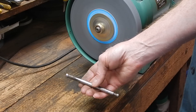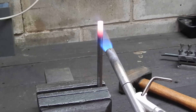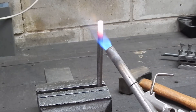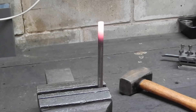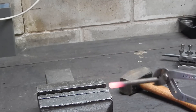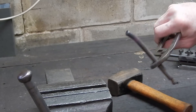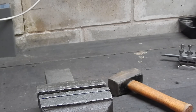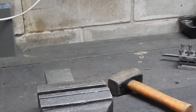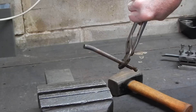As long as it does the job — this is the sort of boring bar you make up to get yourself out of a hole. So now we'll heat that and we'll bend the tip. We're ready to do a bit of grinding now. I'll let it cool down — in fact what I'll do is I'll quench it. I just put it in the water pot and quenched it, so now we'll grind the profile on the end and we're good to go.